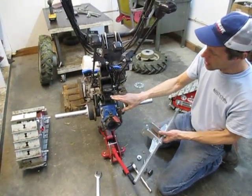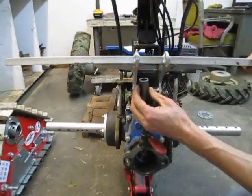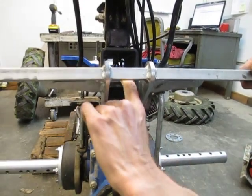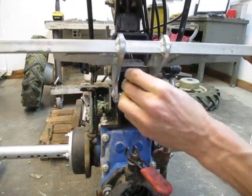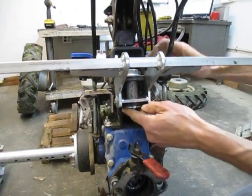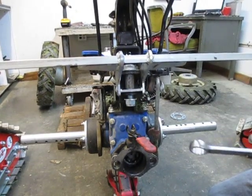On the BCS tractors, this brace bar is engineered to slide in between the tow hitch. This is your tow hitch double clevis right here. It's going to go on top of the lower clevis, and we've got this spacer that takes up the space between this piece and the upper clevis. This is very important: if you put this on the bottom and bolt down through it, you would actually crush the clevis together as you tighten it and it would never stay tight. This system takes up all the space very neatly with a washer on top and washer on the bottom. This is a 27mm nut and bolt.